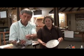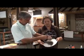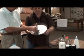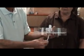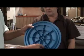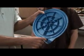So the wick, remember the wick comes down from the base of the wet bulb thermometer. It's going through the center hole on the floor. Doris, can you grab it and pull it through? Okay, there we are. We've now placed the wick through the center hole in the floor. It looks like that. Now, this part can be kind of tricky because we're trying to get this wick into this groove in this compartment, because this is where we're going to put the water bottle. The water's going to be entering here.